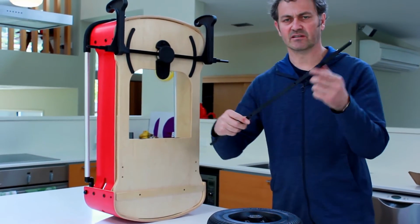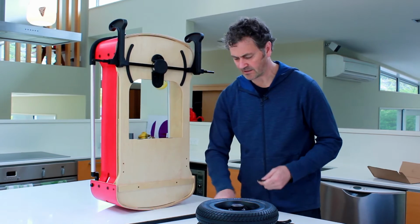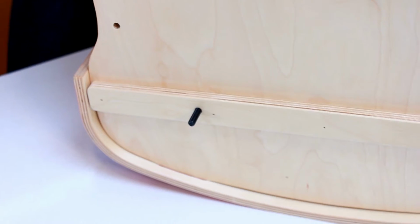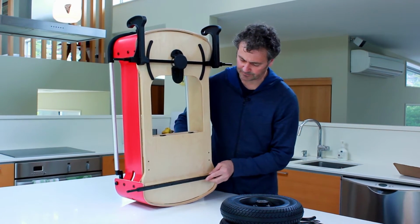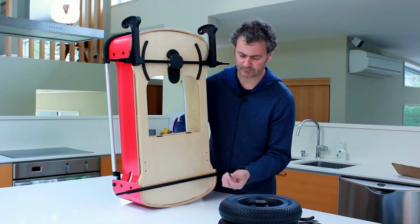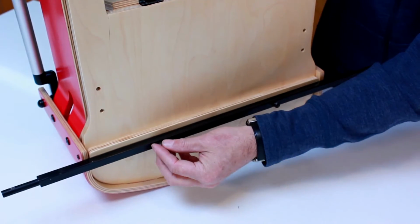So the rear axle is obviously the straight axle with 2 holes in it. And we're going to need the 2 longest bolts to hold that in place. Again, like I did before, what I do is I push the bolts through first. Gives us something to orientate the axle with. Once they're there, we can then bring the axle up to it. One on first, second one on. Grab our nylock nut. Flat side to the axle, rounded side facing out. Just get that finger tight.